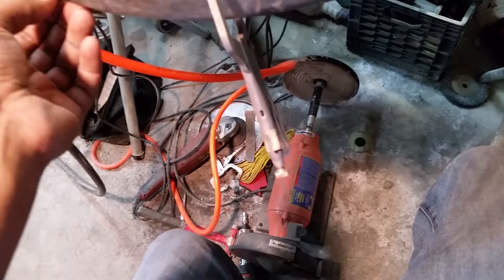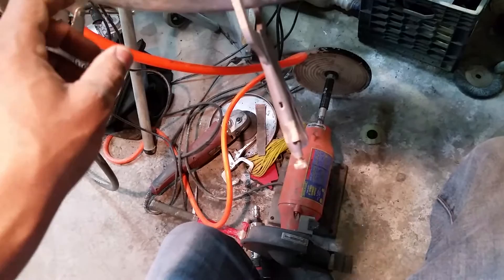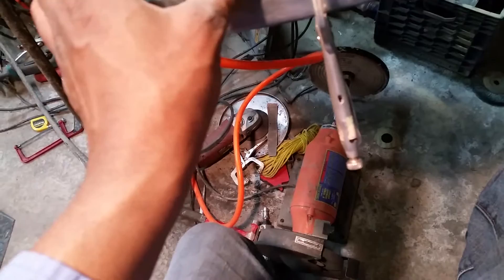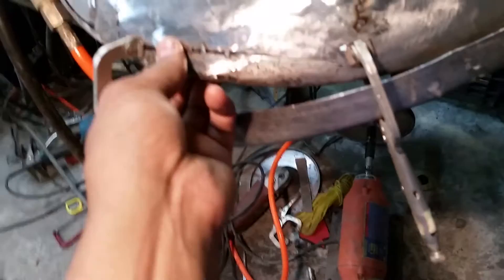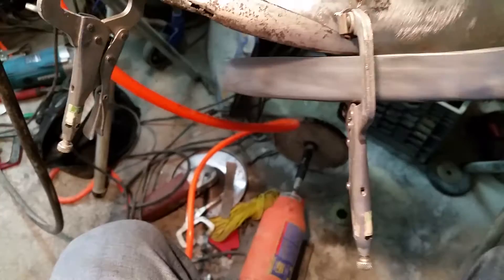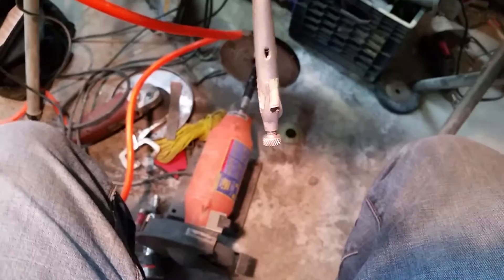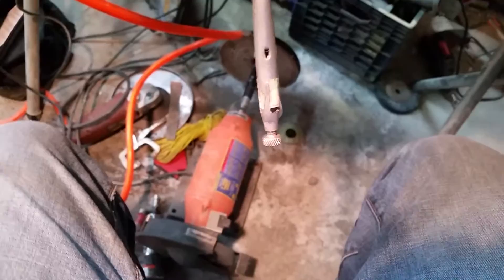This is the lip I fabricated. I'm going to cut a very thin line here — probably to about this section. Once I get this piece welded in, I might put a patch that comes down to the new piece because this metal pretty much has to come out since it's rusted, but I'm keeping it there as a guideline for the back side. I'm basically replacing this part with the flat part here. I can see how it's managed over there — I'm rebuilding it now.